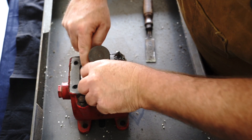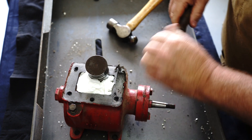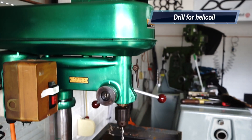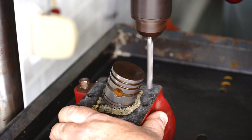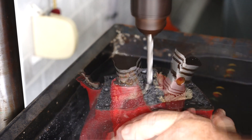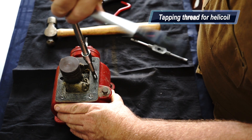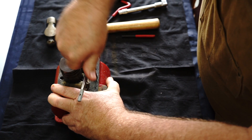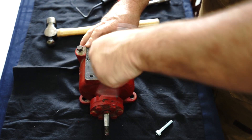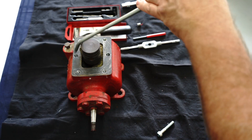Now it's time to scrape the gasket off. I put some tissues in there and started removing the gasket using an old carpenter's chisel. Then over to my wall-mount drill press — the threads in here are actually Whitworth, so I'm going to drill them out and helicoil them with a metric M8. The drill bit used is to suit the helicoil M8 thread, then I'll use the tap supplied in the kit to tap all those holes. Once tapped, I blow out all the chips from the holes. I had a rag in there to stop any debris falling down inside.